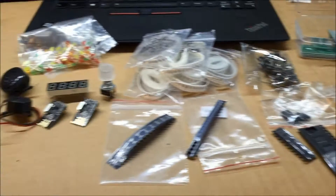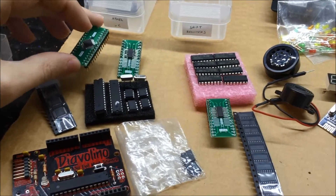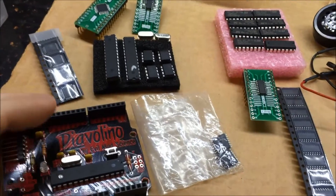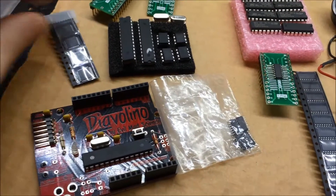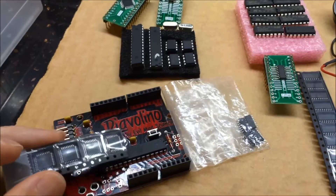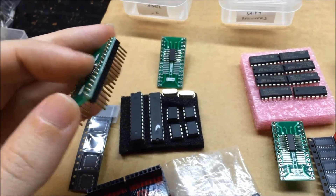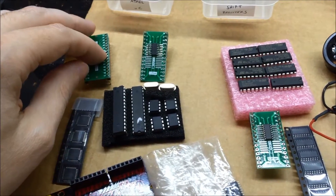This video I want to show all the parts I've got for mom's timer and I want to get one of the microcontrollers programmed. Here are all the different microcontrollers I'm playing with. To make it Arduino compatible like this Arduino development board, I'll be using an ATmega 328. Rather than the through-hole part, I'll use a surface mount version — it's the same exact chip. I've got these little adapter boards that let you put a surface mount part on a breadboard. This is the microcontroller going into the main unit of the kitchen timer.